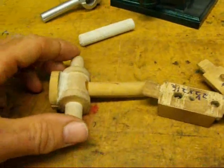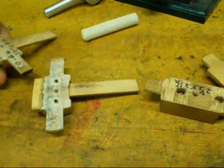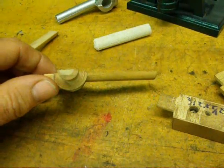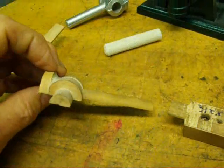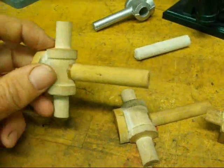You see it goes on a little vertical engine and the other one goes on this engine. These engines I think were shown in one of my other videos. A split pattern is used to make a mold that has two halves. This is called the parting plane or the parting line. Half of it's on one side, half of it's on the other. So this tapers toward one side, the other piece tapers toward the other side.